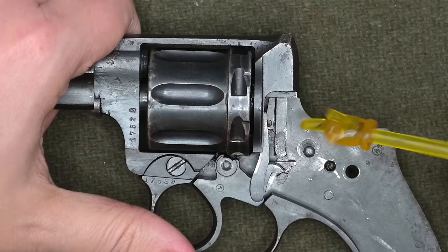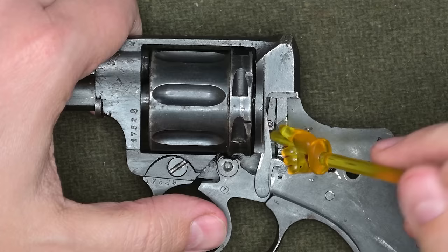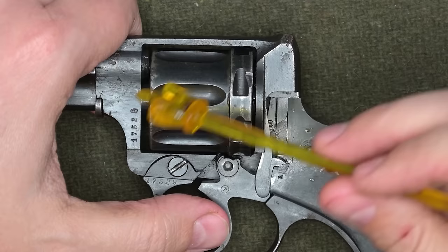And it's working on a vertical block. This is actually a locking block just like you'd see on, say, a Winchester rifle. And what it does is it rises, tips, and supports a rotating breech block, which we can barely see the bottom of here. When that happens, the breech block and hand are going to push the cylinder forward, and that's going to seal up our system, compressing that spring at the front.